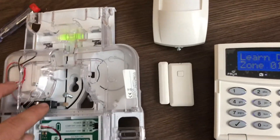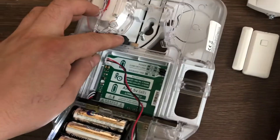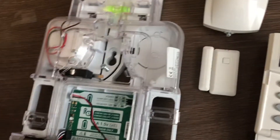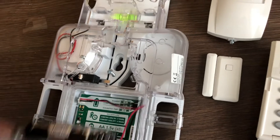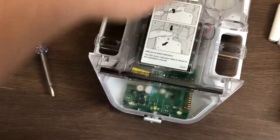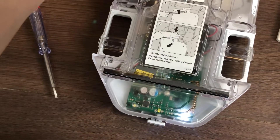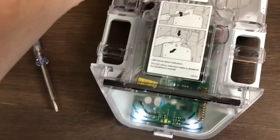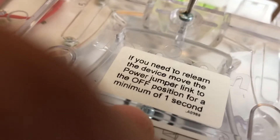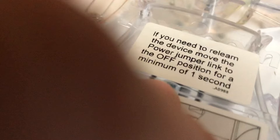When you put this up, it's really important to ensure that the tamper switch is down. To do this, all you've got to do is tighten this screw here, which will stop the tamper lamp from going off. Close the lid up, and if the tamper switch is closed, the light will move over. Close it and it moves over to show it's closed. It goes into engineer standoff mode. Tighten the screw to keep the tamper switch down.